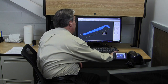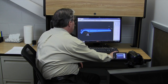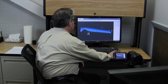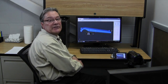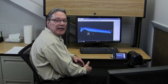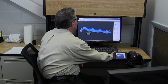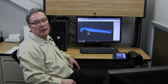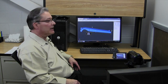Let me rotate this part around on the screen. We see the A surface now on this. Looking at the B surface — everything looks pretty straightforward. This is a pretty cut-and-dry design. We've got our outer dimensions on the part and material volume is already listed. We'll go back and check the data to verify there are no errors and that it doesn't need any repair. That's as simple as going to Tools and Verify, and the screen shows we've got one part, one shell, and no errors. The file is good to go.